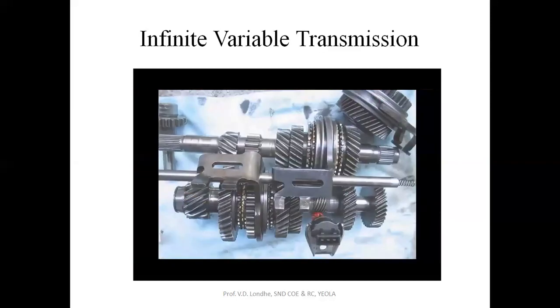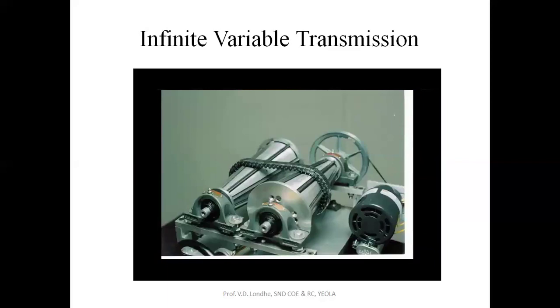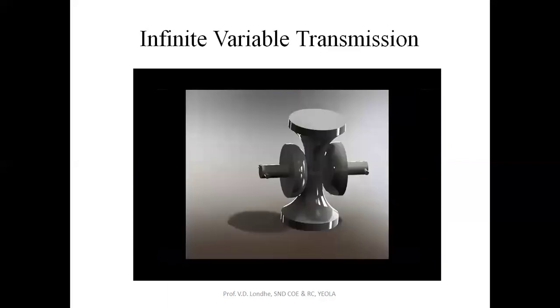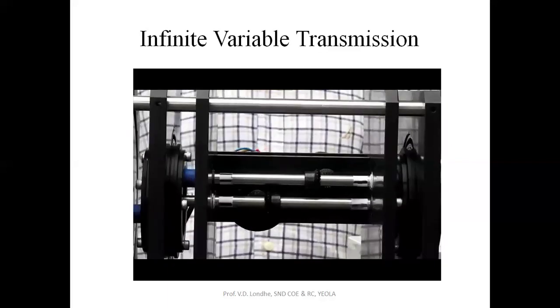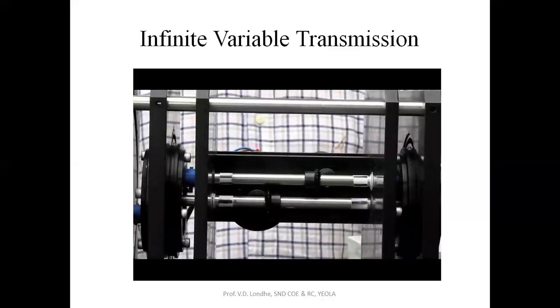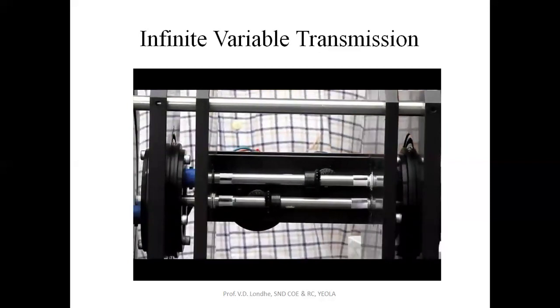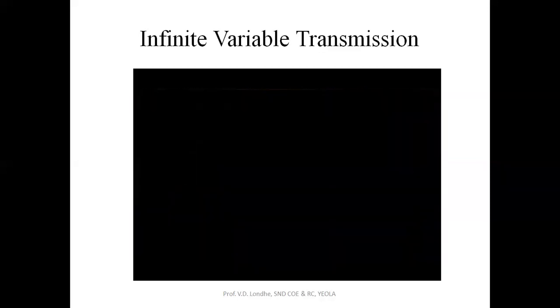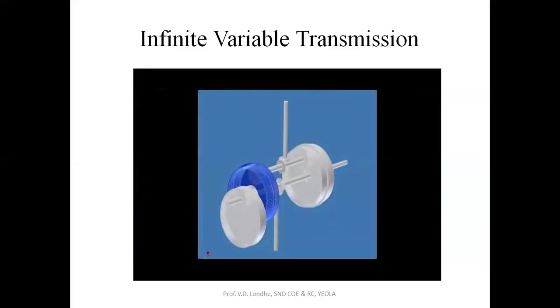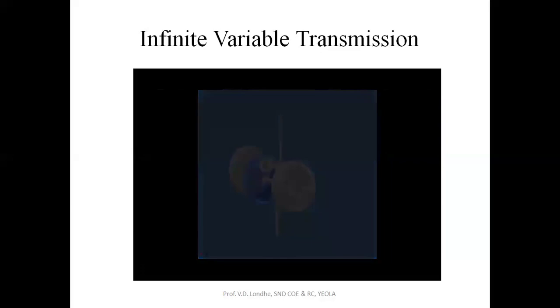With most transmissions, you can easily see where the gear ratios come from. You'll have small and large cogs, for example, or in the case of a CVT, there'll be some sort of ramp or a slope. With the D-Drive, there's nothing of the sort that you can look at. Instead, the ratio of input speed to output speed is determined by the relative speeds of these two spinning shafts. As you slow one down, the other one speeds up. When you lock the bottom shaft so it's not moving, the top shaft spins at top speed and power gets transmitted from the input to the output at the device's maximum gear ratio.